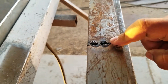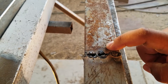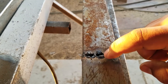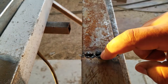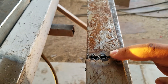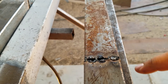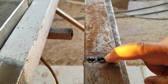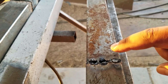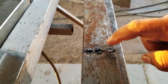When you finally have a hole, you use the same technique — only instead of going across, you're going to jump the two pieces of metal. You build up material on one side, then build up material on the other side, and then continue that all the way around until you can finally close it. If the holes are too big or the material is too thin, welding around the hole will just make things worse and might end up making the hole bigger. So if possible, just do it in tacks and in small sections as you get closer to finishing. That way you apply the least amount of heat and hopefully you don't warp the material too much.